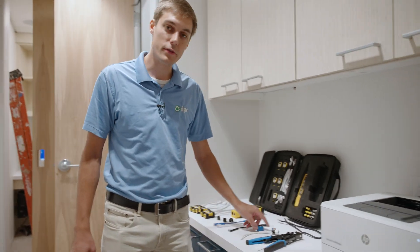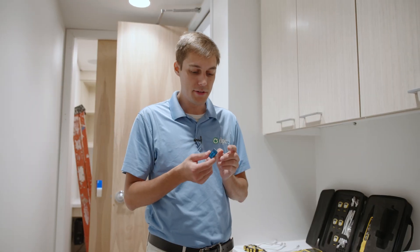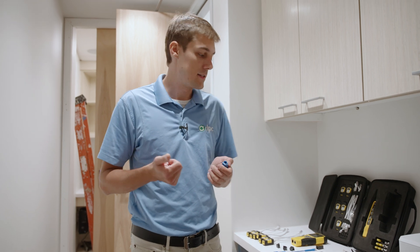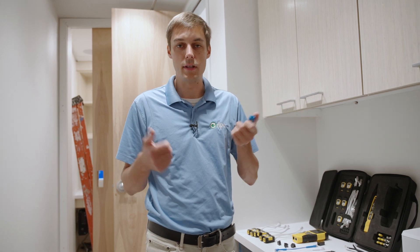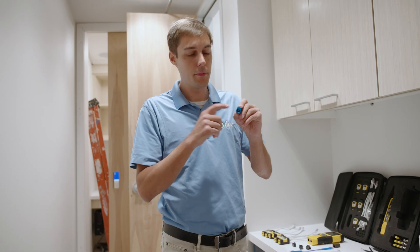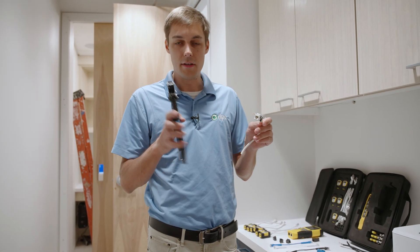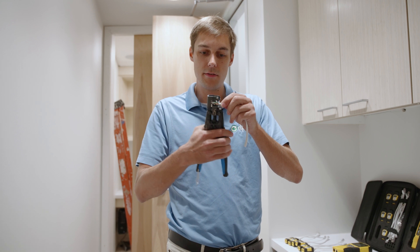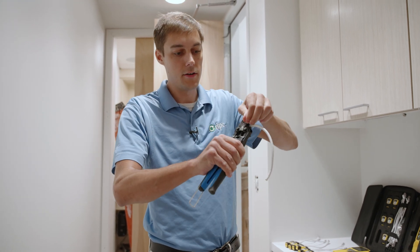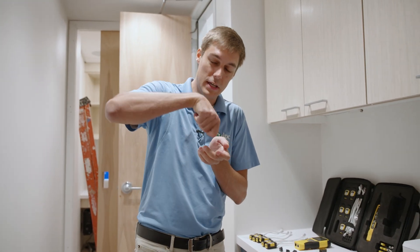The next thing I wanted to cover is we use the Vertical Cable patch keystones. These are a little bit fancier than your typical ones — a little pricier — but they come with the benefit of being a lot quicker to terminate, and it looks really clean in the end because you have different colored keystones for the different patch cables and different positions on the patch panel. The main benefit is you can get the Vertical Cable termination tool — it's just a crimper. It slides straight into your tool, you screw it down, all your little pieces pop off and you're done. It's a lot quicker and easier than having to manually punch down each keystone by hand.